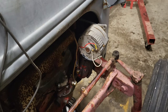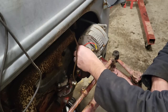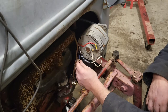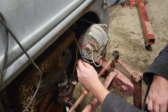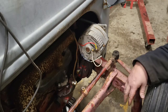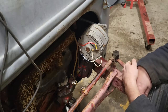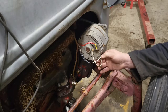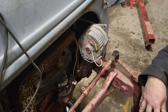I might redo it one day with heat shrink, but for now good enough. I do have an extra wire here because this wiring harness was actually meant for the generator, which would have had a wire going back to the voltage regulator. I'm just going to leave that there — you can't uncut a wire. I'll probably end up strapping it back to keep it out of the way, but just in case at some point I decide I want to run this back to the battery to regulate voltage there, or if I convert it back to 6 volt, that wire will be there. These wires look a little rough — I'll probably end up replacing them when I try to make this pretty, but that's going to come after the W6.